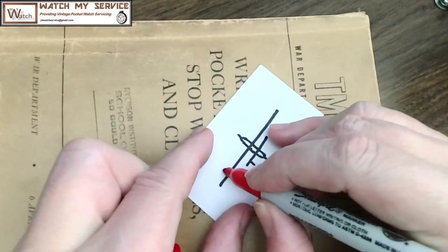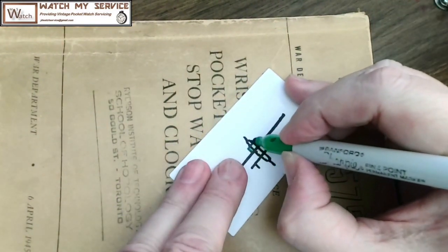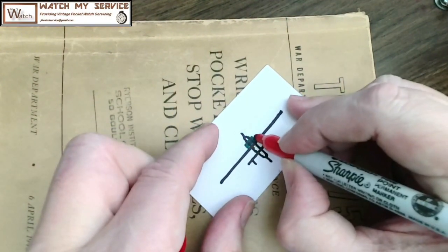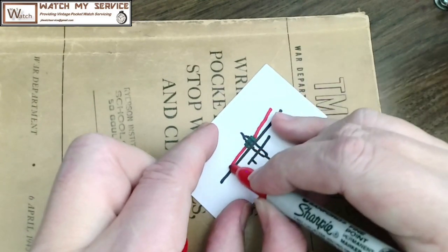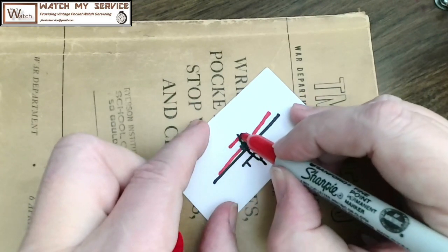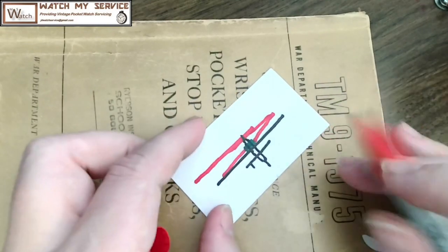So this is the hairspring. If the hairspring is not studded properly, let's just draw the stud. There's the stud, S-T-U-D, like that. And if this is not studded properly, your hairspring could be at a bit of an angle. Let me see if I can draw this. I'm going to exaggerate the angle. It could end up like that. That's pretty exaggerated, but I've had this happen before. Say the bridge is here, like this. I should draw the bridge in black, but say the bridge is like that, and the hairspring would go around and then attach itself like that.